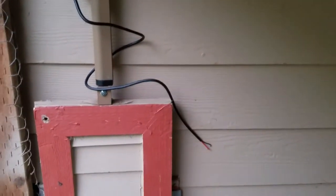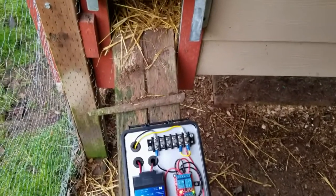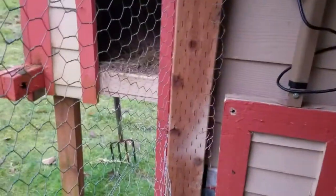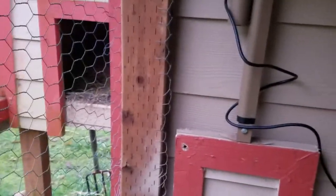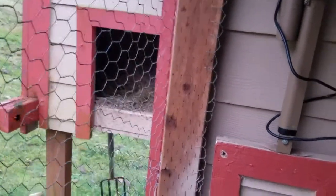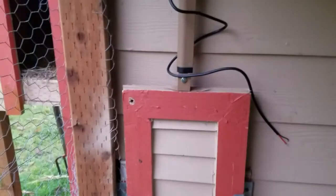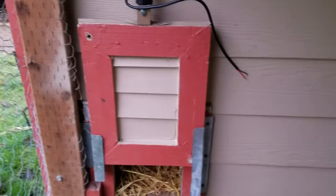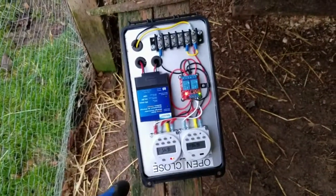I'll leave the door up for tonight, and tomorrow I'll come out and build the mount brackets for the solar panel. The control box will get put in that little nesting box on the side of the coop. I'll run the wires over there, face the solar panel south — which is easy because the coop roof faces south — and set it to the right angle to maximize charge time on the internal battery. Then get it all hardwired in, set the timer, and we'll be ready to go.